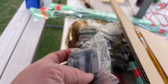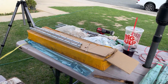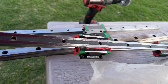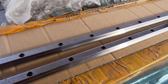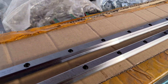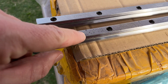These are generic brand blocks and rails from China — not Hiwin brand. You can see the difference: they have a black stripe underneath. I put these on for comparison. These brand new Hiwins — I took them out because I thought they were rusting, but it turns out the oil they're packed with had oxidized, which looked yellow. I was able to take acetone and rub the oxidized grease off, but it does leave a little bit of a stain. I don't feel pitting — I can feel where the laser etched the Hiwin logo, but no pitting.